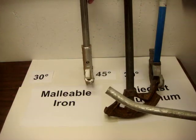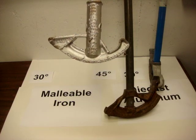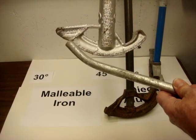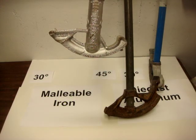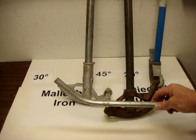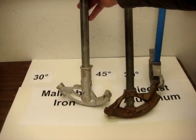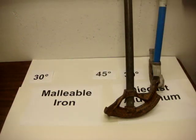This one has very few markings. You cannot tell when you are dealing with a 10 degree, 15 degree, or 30 degree bend. It marks where you can bend your 90 degree, and when the handle is vertical you have an exact 45 degree bend. I do not use these benders — there are still plenty of them around, and many are for sale on auction sites, but they are very difficult to use and make accurate bends.